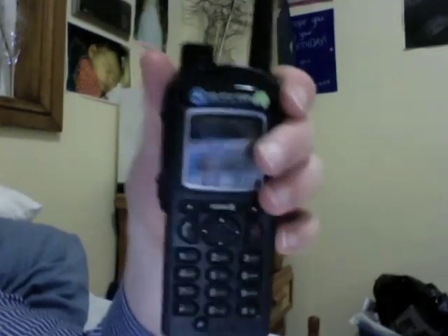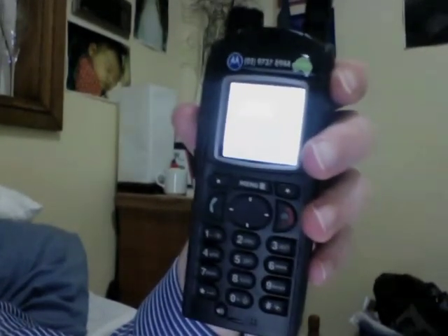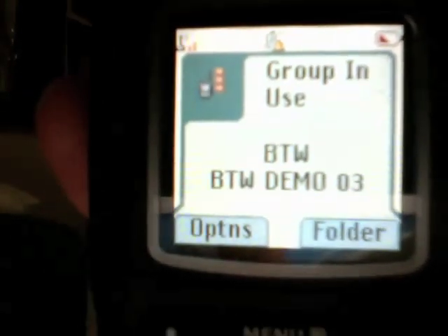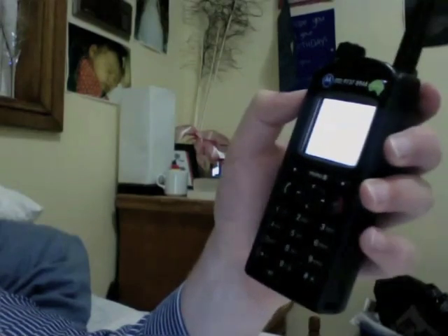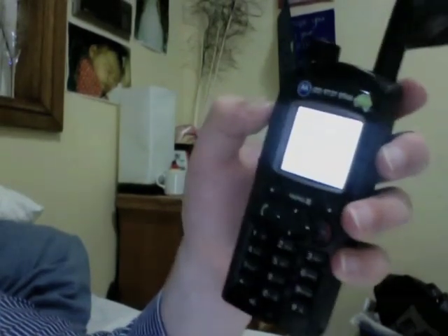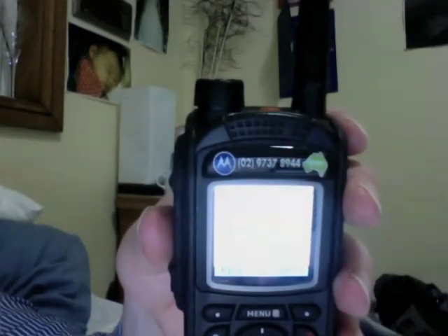One of the main problems I had is the talk permit tone. Any time you want to broadcast, you hold down the push-to-talk button and you hear that tone, which means you're free to talk. The problem is that half the time when you want to talk, that tone doesn't appear — you press push-to-talk and the screen just says 'please wait' while it tries to connect to the network. At the moment it's clear, so you can see the second I push push-to-talk it says 'group in use,' meaning I'm free to broadcast. But often walking along the street I'd press push-to-talk, the radio would just beep and say please wait. Also, I'd get the push-to-talk tone, talk for maybe 10–15 seconds, and then all of a sudden the radio would start beeping telling me I had no network coverage, and my radio call would just drop.